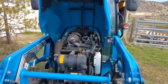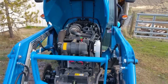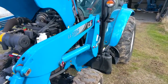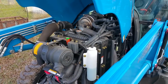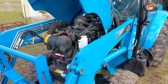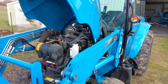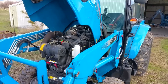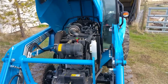If you pop the hood and look under one of the Shibauras, it's got a DPF that's twice as big. When I reviewed the manual that came with this, they referred to that DPF as a DOC plus DPF — Diesel Oxidation Catalyst plus Diesel Particulate Filter. In parentheses they called it a CCRT, which is a continuously catalyzing regenerating technology, meaning for the layperson that it doesn't actually go through a regen cycle.